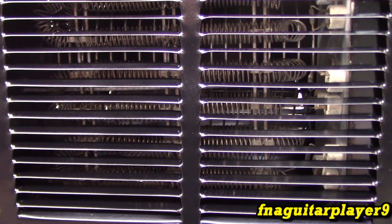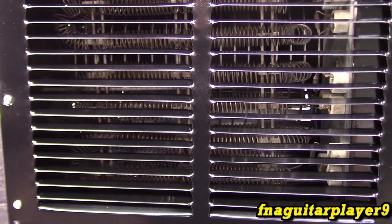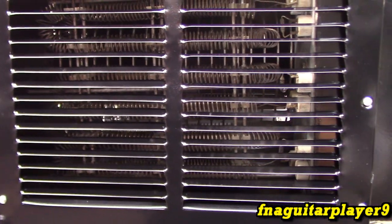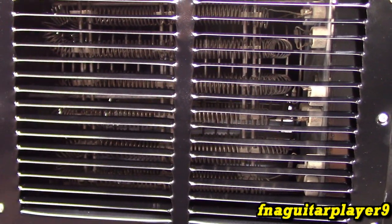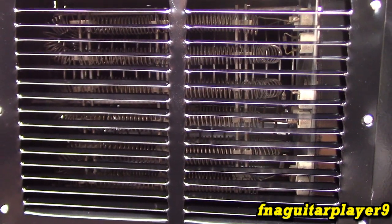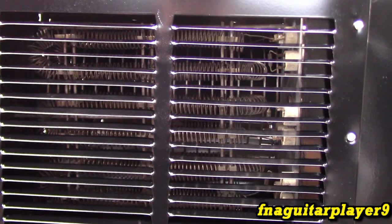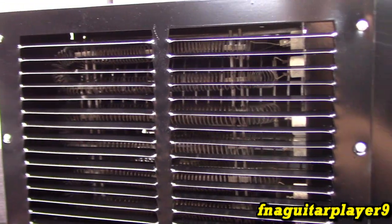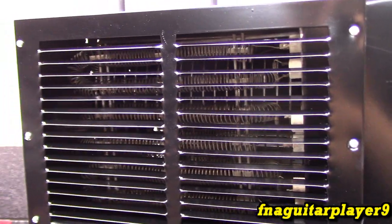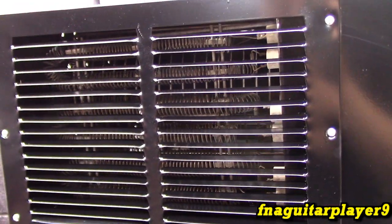Well, guys, I guess that's about it. I thought this might make an interesting video, and hopefully it'll help you build one if you've got scrap parts. Another thing I was going to talk about: do I recommend building one of these? Only if you have access to old parts laying around, like the blower, the heating elements, the wiring, and the sequencers. Don't go out and buy the blower and individual parts. You might as well just buy an electric furnace if you're going to do that, because the whole point of this is to recycle parts and save money.